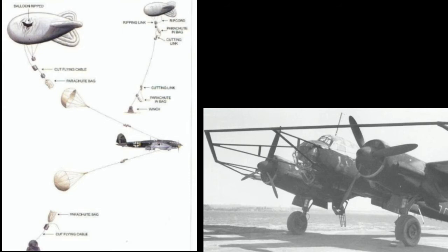Well, the Ju-88 with this fender was supposed to keep this at least from dragging the aircraft out of the sky, but unfortunately the fender itself weighed 838 pounds, which required 132 pounds of ballast to be added to the back of the aircraft to get the CG correct. Now, you can figure that 970 pounds added to an airframe is going to do exactly what you think it's going to do. It's going to cause it to be a big lumbering target. So it didn't last long.